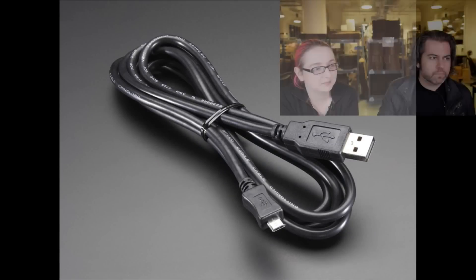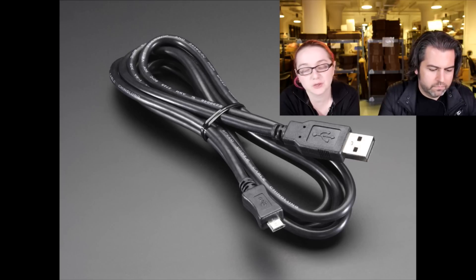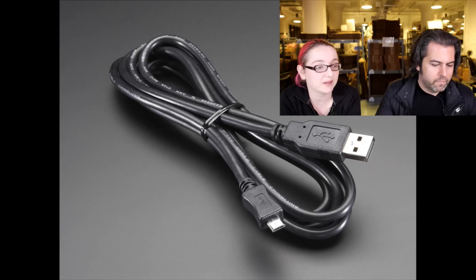Next up, cable. It's a cable. Now it looks boring, but it's actually a really sweet micro-USB cable. This is a six-foot-long micro-USB cable, and the reason it took us a little longer than usual to get this two-meter cable in is that we specified extra beefy wire inside of it. It has 24-gauge power wire and 26-gauge data lines, so it's an extra-thick cable. It's good because if you're using this for high-current draw — like two amps — from a USB power adapter powering a tablet, Raspberry Pi, or BeagleBone, this cable will have less voltage drop. It was a custom-made cable because we didn't want to cheap out. Usually if you get a two-meter cable it's 28-gauge or 30-gauge wire — super super skinny. This stuff is much better. So we have that in the store now.